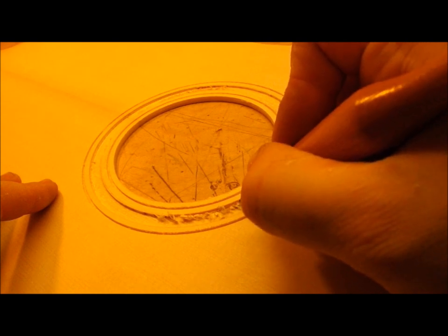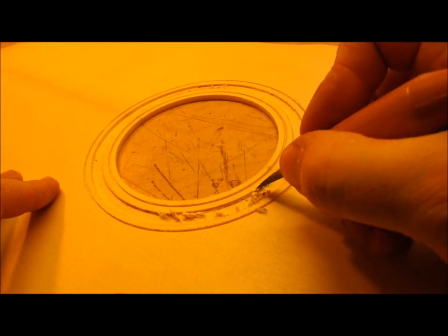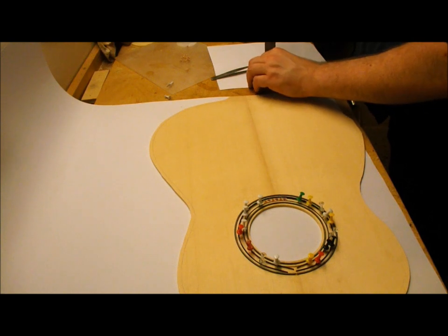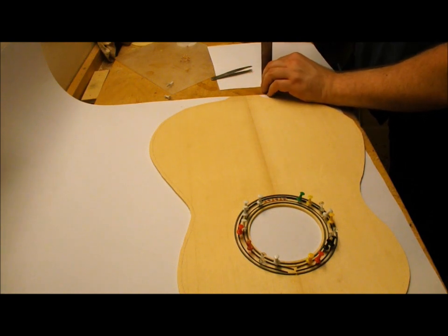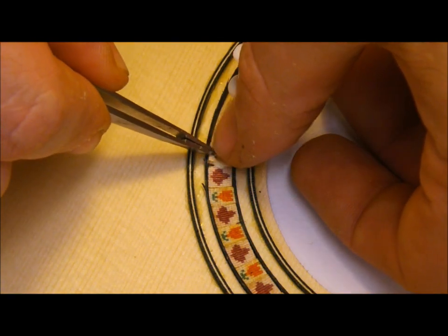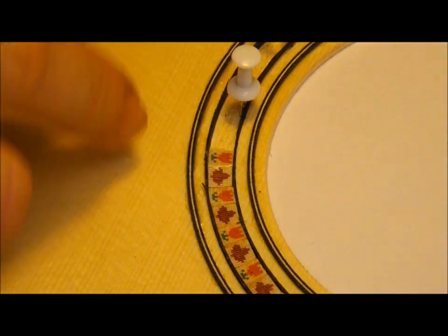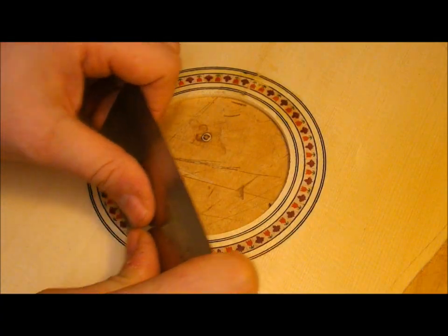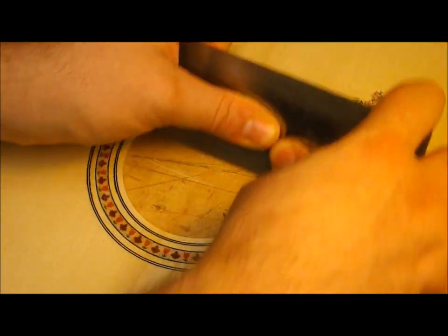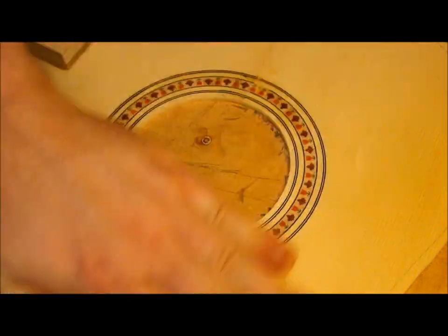At this point the black bordering lines are just held in place with thumbtacks — not glued yet. Each individual tile needs a couple of chisel cuts to make it into a slight wedge shape so it butts up against its neighbors. I put glue on those and set them in place. Eventually the entire pattern gets covered with thinned glue, which swells everything up and really locks all the individual tiles to each other and into the rebate. I use a block plane to remove most of the waste, then finish up with a steel card scraper to reveal the final pattern.